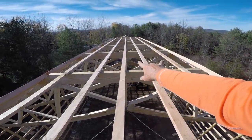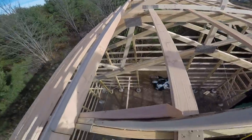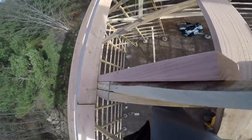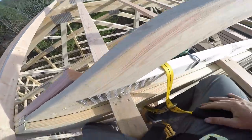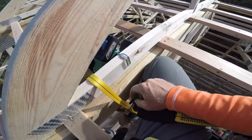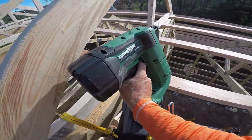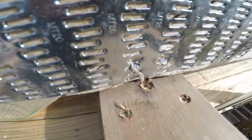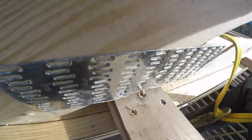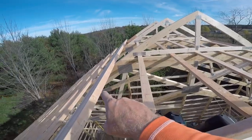This is what we got to do to prepare the top of our trusses. We've got top hats on the way - the spec is to carry the scrap piece top cords, which kind of laminates it together, and then gets toenailed on each one of these purlins. The Hitachi framer - telling you, it's legit. This thing is cordless, 30-degree nails, and look at those toenails - right through the gusset plate, no problem.